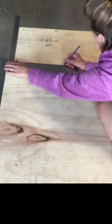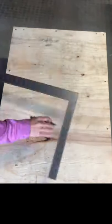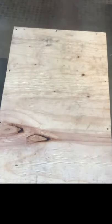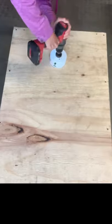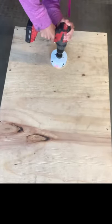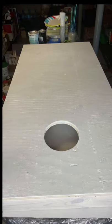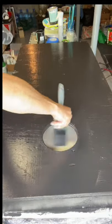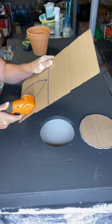To finish this piece off, I measured nine inches from the top and 12 inches from the side to find the center of my board. Once I had the center, I took my hole saw drill bit — it measures six inches in diameter — and drilled a hole in the center of the board. Now you have a cornhole board. I repeated this to make a second one. Now it's my turn to paint this beautiful cornhole that Jamie built, and I started off by painting the entire thing black.